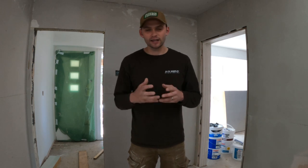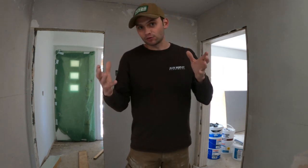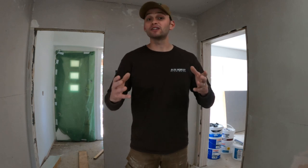Today we're going through how to plaster a wall. The job we're on at the moment is a new build house — we've gone through the whole house boarding and plastering upstairs and downstairs, and the last bit to finish is just this hallway. Normally you'd start with the ceiling first so nothing drops on the finished walls, but I don't have quite enough beads to finish the ceiling, so we're going to focus on two or three walls. It'll be a two-coat finish, and there'll be no sponging on this one, though I do thoroughly recommend sponge floating if you're new to plastering.